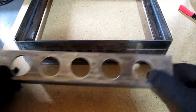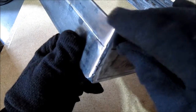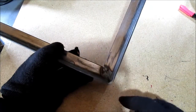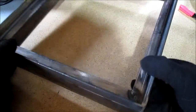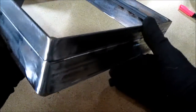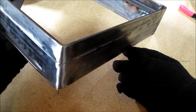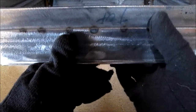It's kind of windy, can't weld much. We didn't tack our corners. They left a little bit here. We might take the Dremel and kind of grind that out because it kind of goes over. But it worked good. I'm really happy having a MIG welder where I can tack little things. See how nice the corners look? The bottom is worse than the top. Here will be the top that you'll see most of the time. I put more work into the top 2 corners. I think you can see that. Like I said, most of the welds are on the inside.